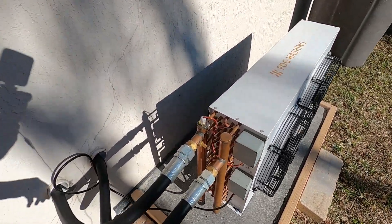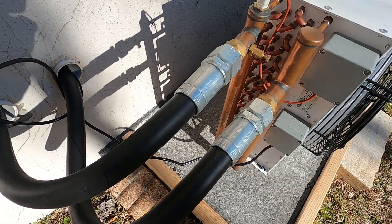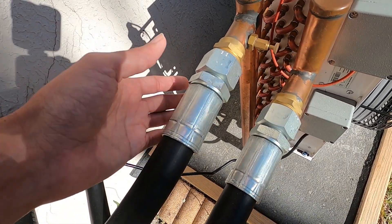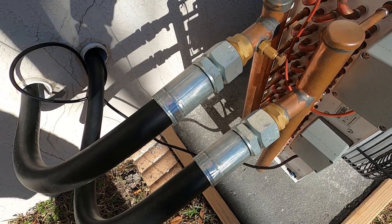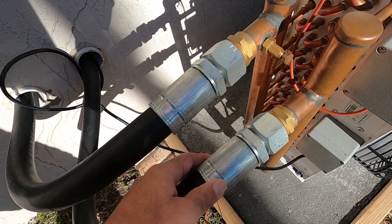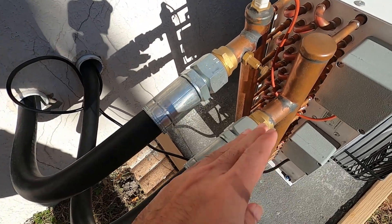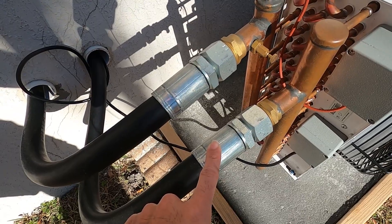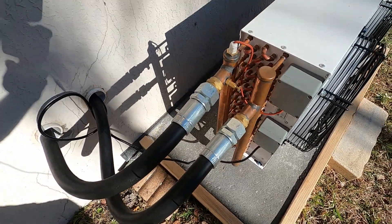Sorry if the mic is picking up wind, but as you can see these fittings are nickel. One theory is that the nickel is leaching into the system — as the fluid goes through these rubber hoses, it reaches this point touching the nickel and leaches into the system. That could be bad if the parts-per-million count of nickel climbs up extraordinarily high. As long as it doesn't get any yellower, we should be okay. I still need to call the hydraulic shop to confirm whether these are nickel, or if it's grease on the inside and outside that has leached in and discolored it.